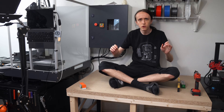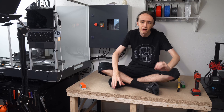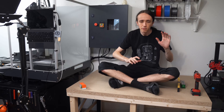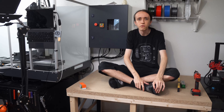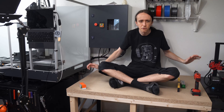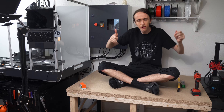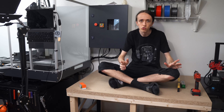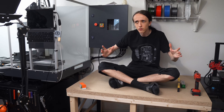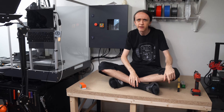Part of wanting to get the very most out of this machine means I need to be very precise at every single step. A large router like this one — which is 1 meter by 75 centimeters — it's not large in the router space for woodworking, but as a hobby machine it is relatively large. It is very important to have a flat base to start from. If your table is crooked or twisted and you put the relatively weak frame of a CNC router on top, it will definitely also take that twist. And then if you have the machine frame twisted and you start cutting, your workpiece in the end is also twisted.